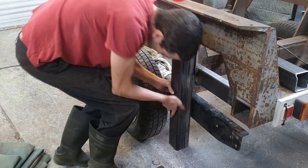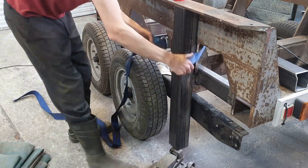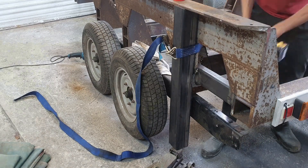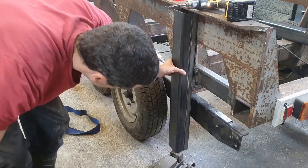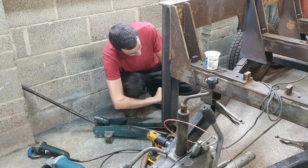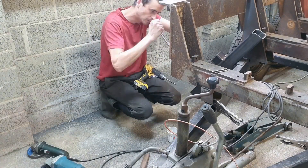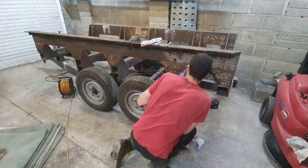So now that one is done, I can get the next leg which is only tacked together, and I can translate that hole back onto the leg. I come behind that leg, drill through from behind the rolling road. So then I can do this with all three legs — and I've now got all three legs exactly the same so that any leg can fit in any location on the rolling road. Now I'm using the first leg — my jig leg if you like — to translate the position of those holes onto all the other locations on the rolling road. And you can see I'm taking those holes out again, getting all the way around the rolling road.